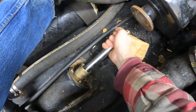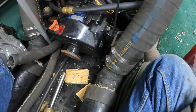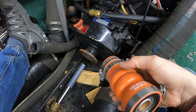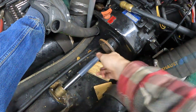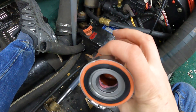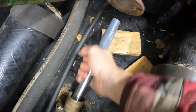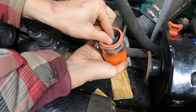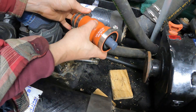Now we're going to push the prop shaft back and grab our seal. It comes with an installation tool. I'm going to take the seal — there should be a cardboard packing sleeve right there, you want to remove that. You can see there is some goo on there already. I'm going to put a little dish soap on this just to help lubricate it and slide it in, and once it gets wet none of that dish soap will stay there anyway. We're going to take the installation tool and put it in here on the seal like so.